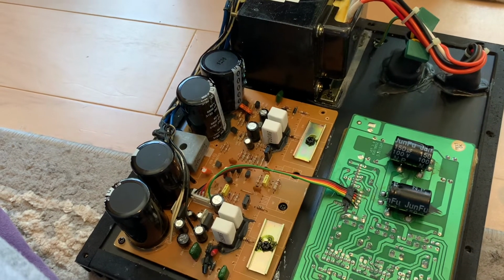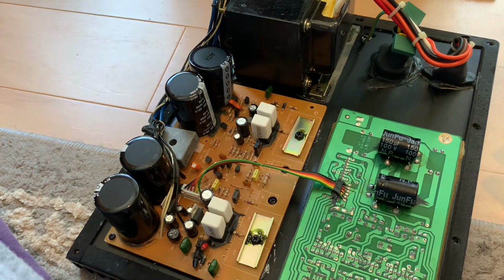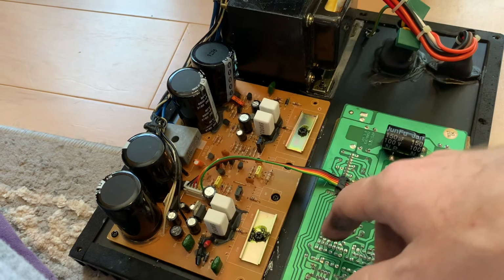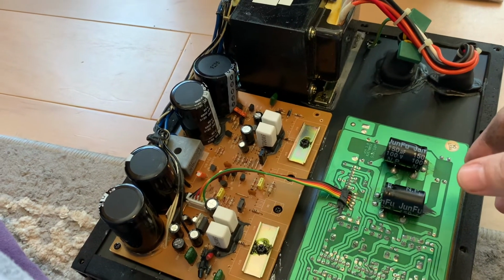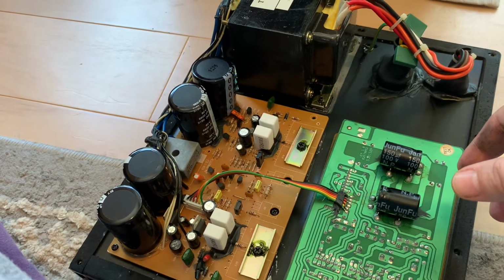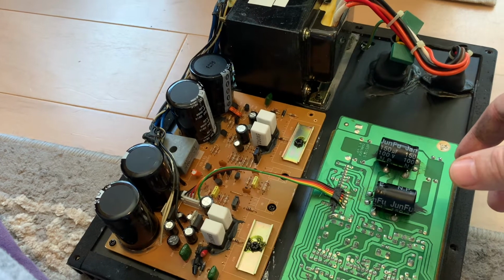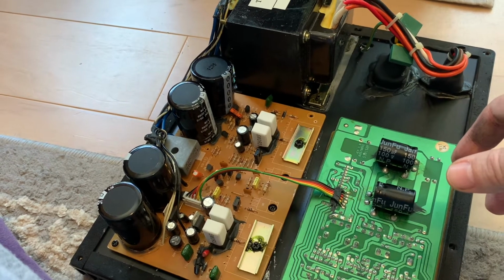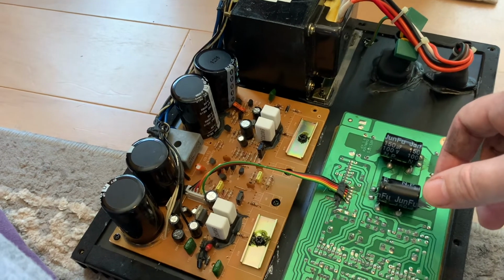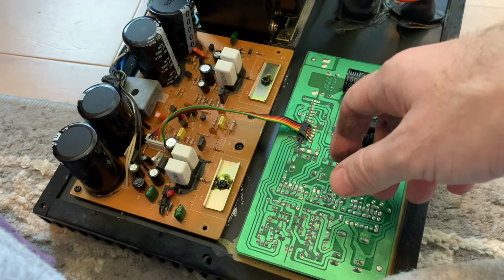And when you tweak and tune an amp or a plate amp or your subwoofer, then you can toy around by removing the original capacitors and putting in better quality ones which have lower internal resistance, lower internal inductance, lower leakage, higher voltage rating, maybe higher capacitance, and you can play around with things. But for the power transistors, you are much more limited.